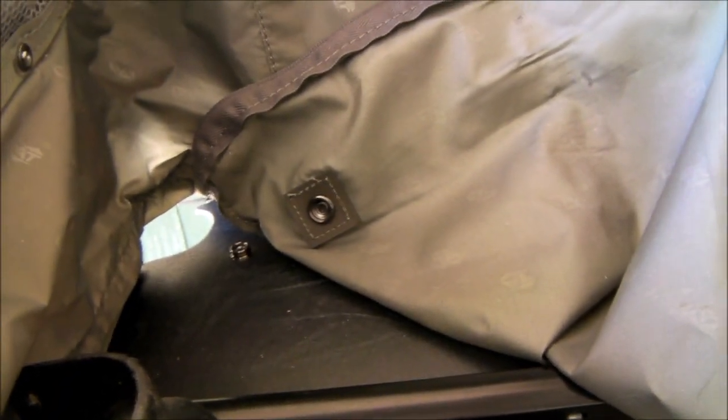So that's my tip for you today: you've got to make sure you find that zipper, which will give you access to see what's underneath. Use a large drill bit — probably larger than you think you need — to remove the heads of those rivets, then disassemble them, replace the wheel, and then use either nuts and screws or new rivets that you can probably find at your local hardware store to reattach the wheel assembly to your suitcase.